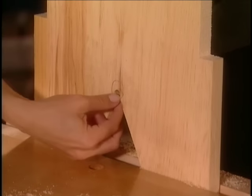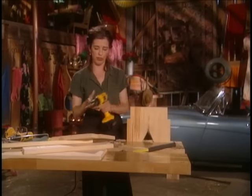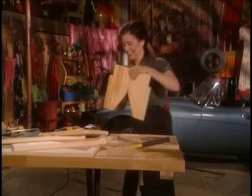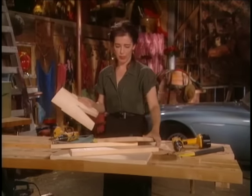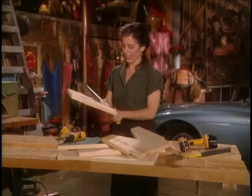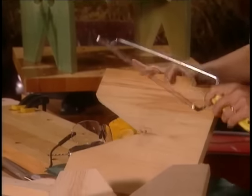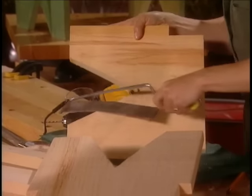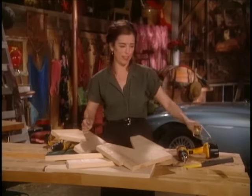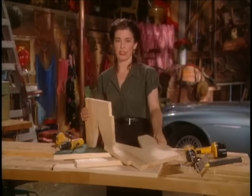I've just drilled this little hole that I'm hoping will stop the board from splitting if it ever gets the idea that it wants to do that. Here are my two side pieces cut out. It's a good idea to just take the rough edges off — you're looking to avoid the slivers. This is a cool little tool called a bow sander, because it's like a bow when you play the violin. So there we have it — we're ready to assemble. You can put the two side pieces together just for fun to check your accuracy.